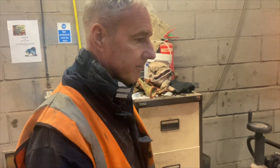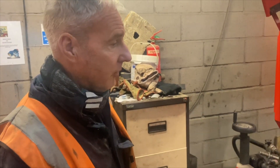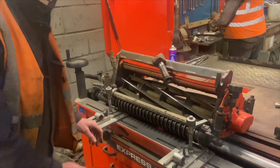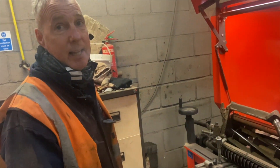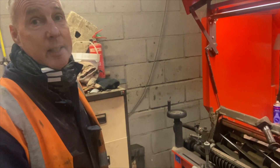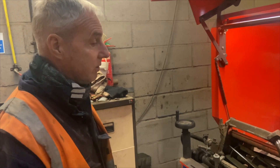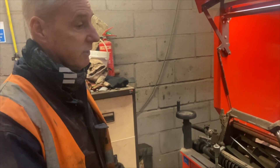During the service we will check bearings and everything of course we do, so to be able to just do this handling and sort of mid-season maintenance grind is perfect. When we get the machines in for winter maintenance, everything's checked — all the cylinder bearings, all the rollers — anything that needs doing, we replace it: bearings and cylinders. Because of the amount of cutting we do, cylinders we probably go through a lot quicker than you would on a sports ground or a golf course, so we've become pretty apt at stripping cylinders out and replacing them. Nothing goes away — everything's done here.